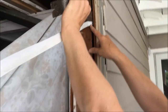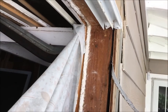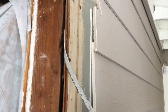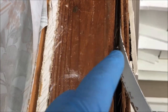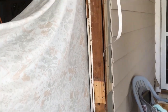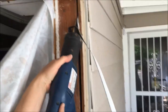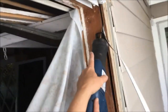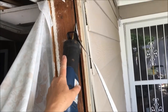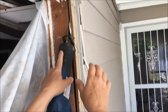She sees a nail right in there and needs to get it out — just to get the nail free so she can get the blade behind it. She used the flat bar to pull the nail out a little bit. Now she's going to take the reciprocating saw and cut that nail — slip the blade behind it, not in front. Get your shoe up against the surface so it's stationary, start off the nail just a hair. You can feel it. You hear a little thud and it's free.